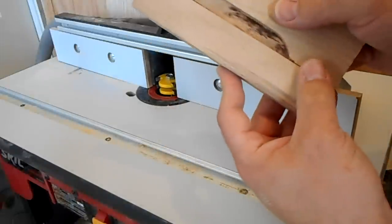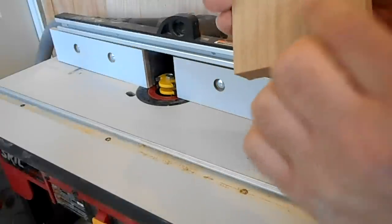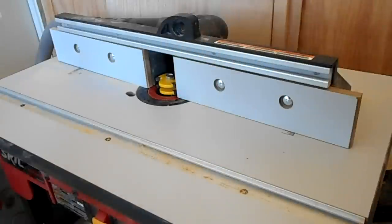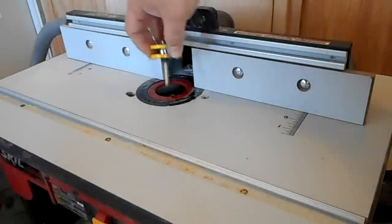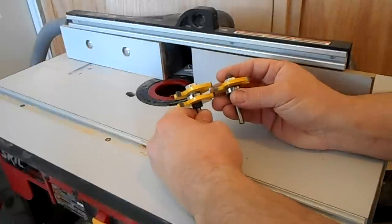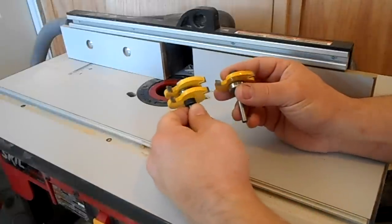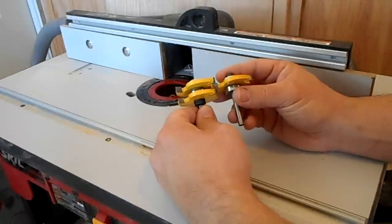When I stick a piece of wood in, it cuts the top and bottom and leaves me a quarter-inch tongue that fits right into the groove. When I'm done, the wood faces should line up perfectly — and we'll find out, because I'm building a desk right now. That's how I ended up with a setup that works in place of a $100 set for about $25, and it's been working really well so far.